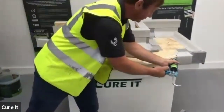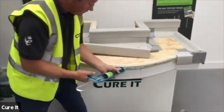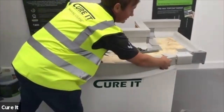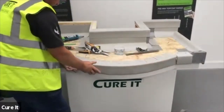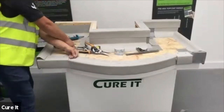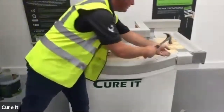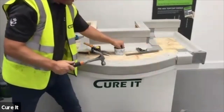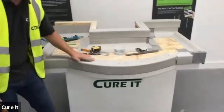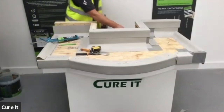If it's a bigger radius, then you may have to reduce the cuttings down slightly. If it's not as severe a radius, then just extend the cut out a little bit more - you've got to make the cut out to suit the actual bend. Cut that out from the other side as well - nice little Vs. This will allow that trim to bend and shape. You can see how flexible it is. We're going to fit it on - we'll pop it in and we know it fits to size. Full continuous bead of adhesive is important - we don't want blobs, because if you put blobs it's only fixed in certain areas. We need to make sure it covers the full entire length of that bead, all the way through. Pop your trim in place - you can see how easily it will shape to form the curve. Press it in place, fix it down, then press the middle in to suit. Continue on, fix it out to form that curve - you can see how flexible the trims are and how you can shape them to make any detail you want.